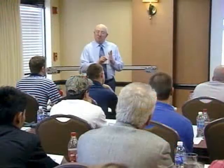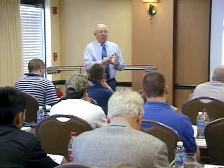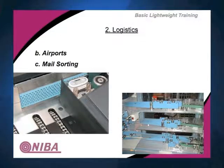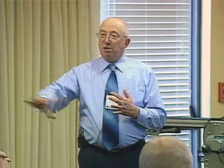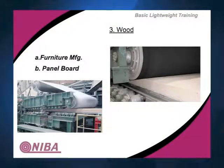In airports on baggage handling systems, flame retardant is also required — same reason. You'll find a lot of rubber belts in here, still some solid woven, and applied PVCs. In the mail-sorting industry, there are a lot of high-speed belts with nylon core that most manufacturers deal with directly with the post office — thousands and thousands of belts. However, in most sortation centers and bulk mail centers, there's a lot of conveyor belt handling packages and bags of mail. Don't go after the high-speed sortation — that is ugly business and nobody makes any money on that.